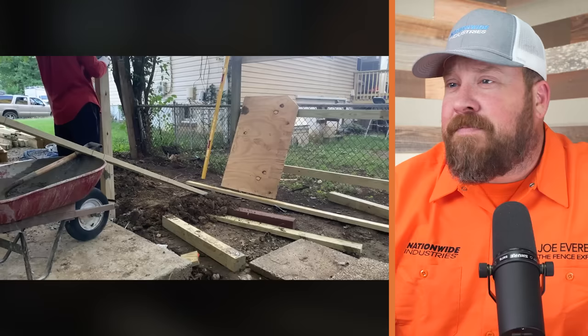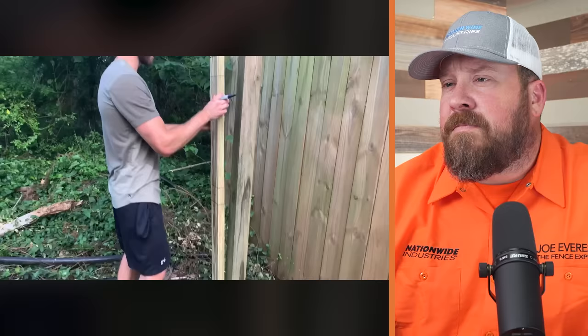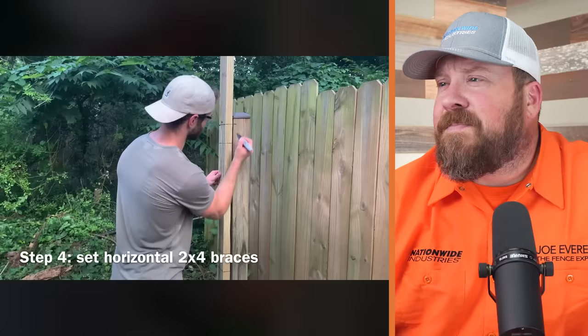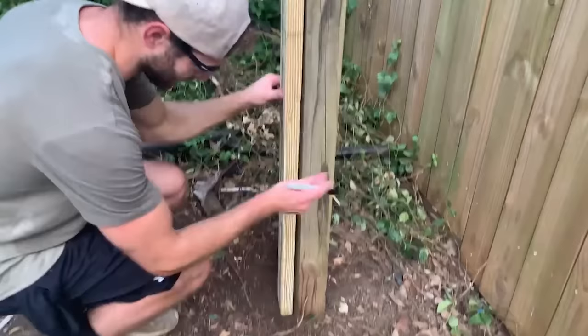Check the level to make sure your post is square and you're good. He found that a lot of the existing 4x4s were in good shape, so he only replaced a handful. My thinking is, if you're replacing most of the posts, just go ahead and pull them all and replace them — for peace of mind. That keeps you from having to go back in three or four years for a few posts. He created a template with one of the 2x4s to mark approximate heights. The reason there's such a big reveal is he's reproducing the existing post heights. From the bottom 2x4, that looks like 10 or 12 inches — quite a bit of room.